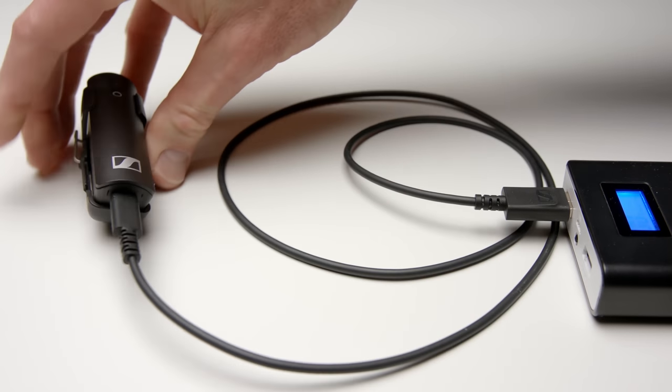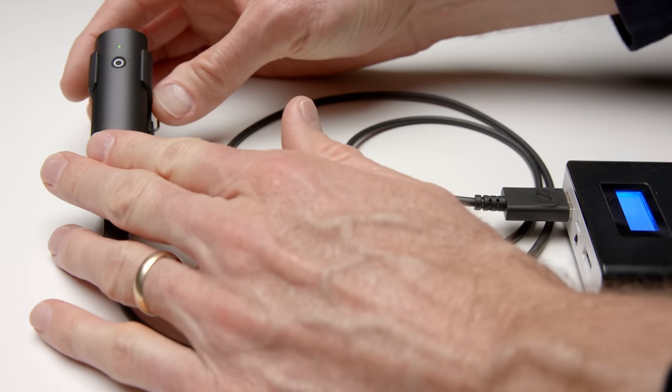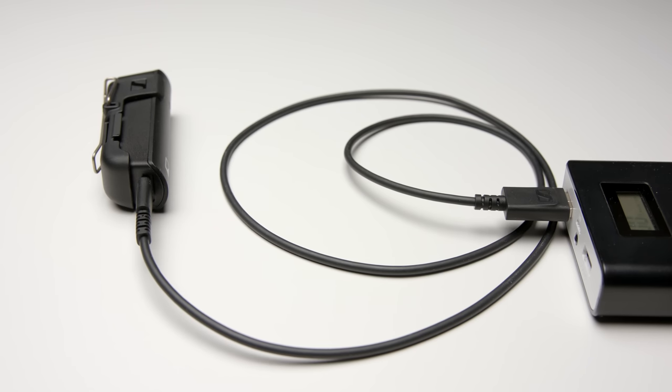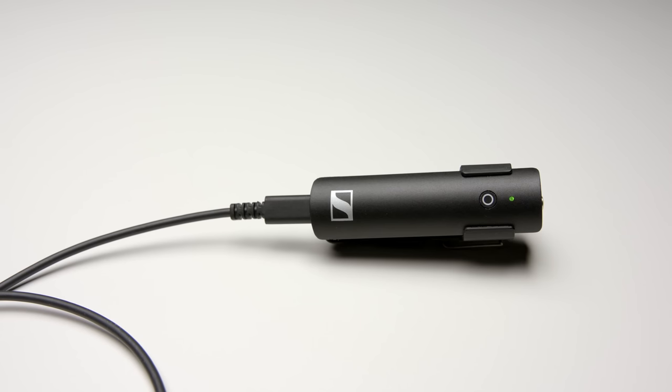Power is another thing that's very simple with the XSWD system. Both the transmitter and the receiver have batteries built into them. In my test we got a total of 5 hours and 14 minutes of powering time in pretty typical circumstances where the transmitter and receiver were about 15 feet apart — and that seems really quite good. You can also plug in a USB-C power source. It has a USB-C input on both the transmitter and the receiver and comes with a USB-C to USB-A cable, so you don't have to have a USB-C power bank. It can power both units for as long as your power bank has power. In terms of charging, in one hour you can get back to about 50%, which should give you about two and a half hours of additional powering time.